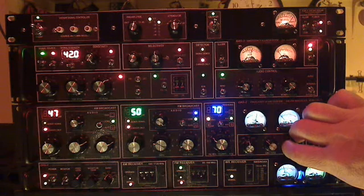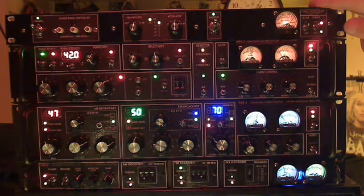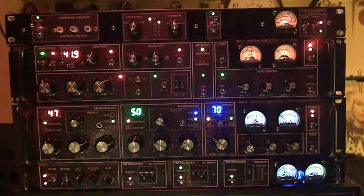It's not very close — we're actually on the fringes of it. So there you have it: VHF/UHF, two 15 dB amps cascaded for 30 dB total gain, three antennas, eight outputs in the back, all multiplexed from the last line amplifier.